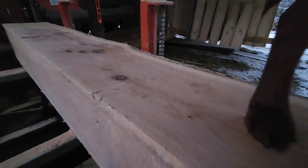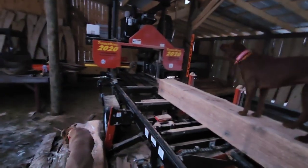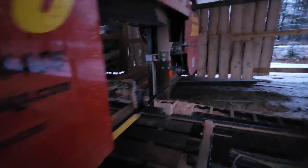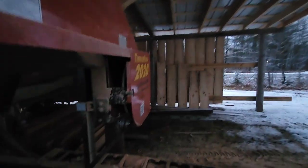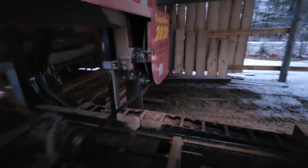Now, I know the lighting is very low right now. I still have life on the blade. We're going to go ahead, probably cut another log with it. So again, we're at 403 board foot. We're going to tack on another 90 some odd board foot there. Yep, I know you can't see it here, but if you look at my nail, well, you can't tell. Next thing I have to do is I'm going to test the set. It still feels sharp to the touch.